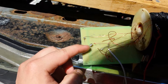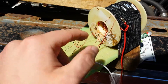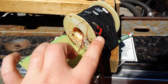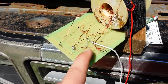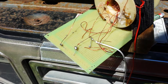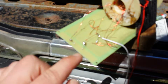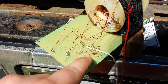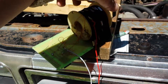The trigger coils are here and here. It looks like it goes from there but it's on the outside. So, top of the coil has two base connections and two drive coils — they're both together on the input. One lead here, and then the bottom ones — one right here goes into right here, and the other one here. That's both collectors separated, just like the base. But the emitters are tied together. The emitter goes all the way down to this lead, which is the negative.